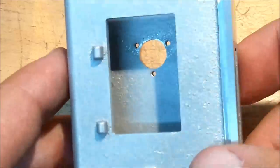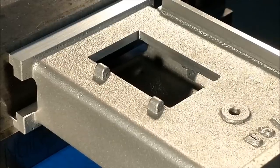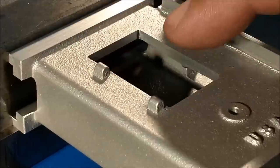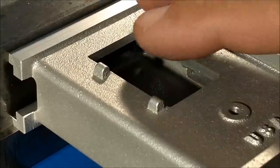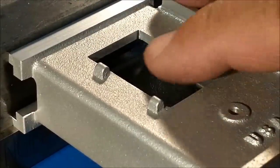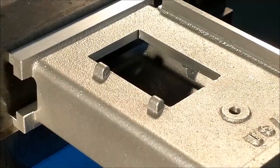All right, let's put this guy back in the machine and make these go away. This will be a very delicate operation if I don't want it to stick out like a sore thumb. So I'm going to just dust these down until I can figure out exactly what the surface is doing here. And I may have to adjust this, shim it, bump it, indicate it, whatever. But these need to go away and not leave behind too much of a trace that they were ever there. Let's see how it works out.